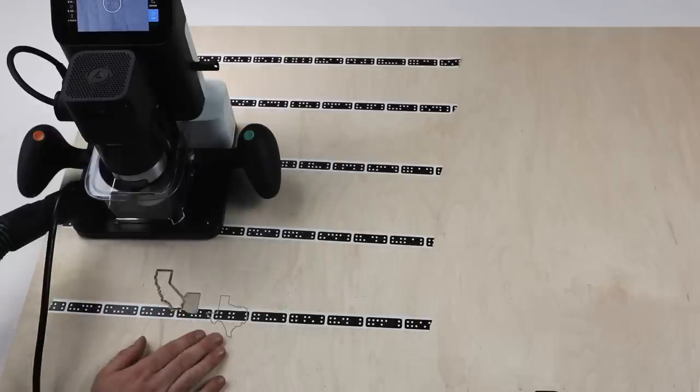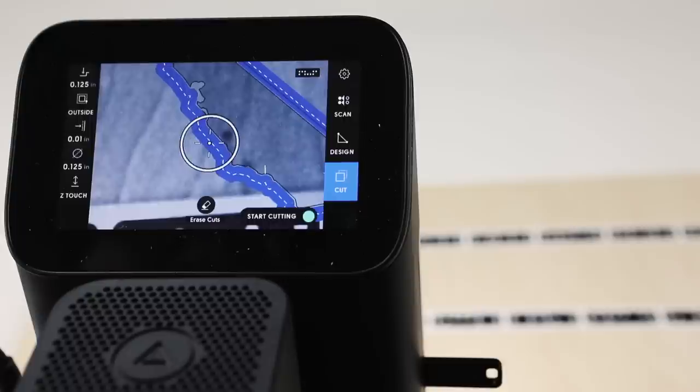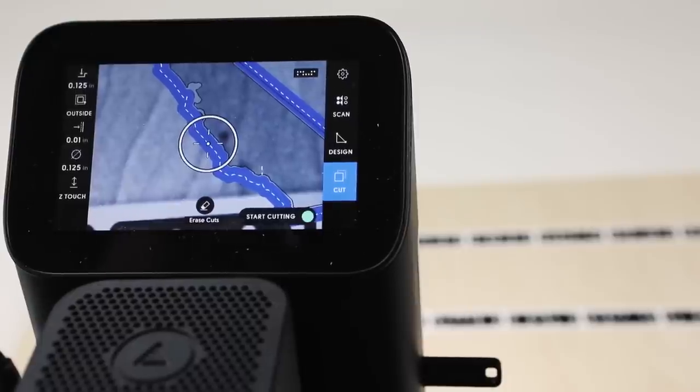So we want to continue moving at a nice speed. You'll get used to listening to what the sound of a good cutter sounds like when it's properly loaded up. We don't want to linger in place. If we linger in place, we generate a lot of heat. The cutter's just basically rubbing against the wood. It will diminish the life of your cutting tool, in this case the eighth inch cutter. But B, it will also burn the wood. Both are a bad idea because it takes a long time to sand out burnt wood, and you just don't want things catching fire.